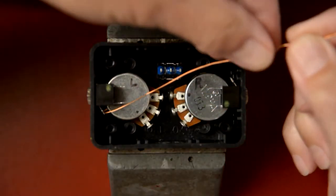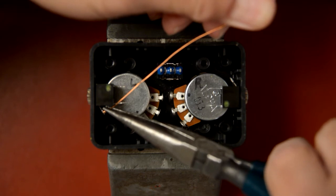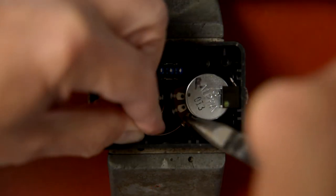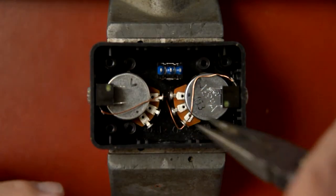And now it's time to wire everything together. First, we run the ground bus wire from one female input jack to the other, connecting through one side of each potentiometer. I used uninsulated copper wire here, since I will be soldering some other connections to it later.